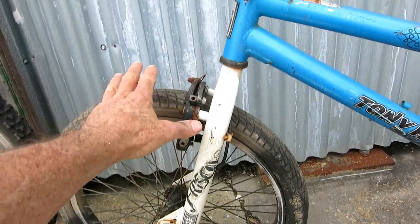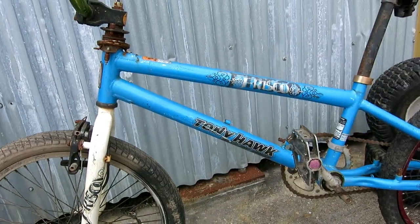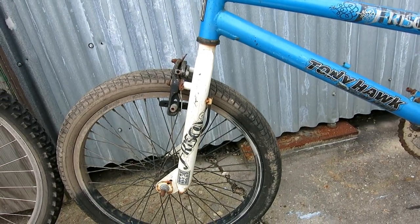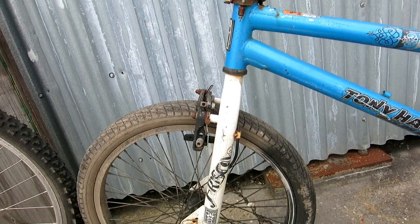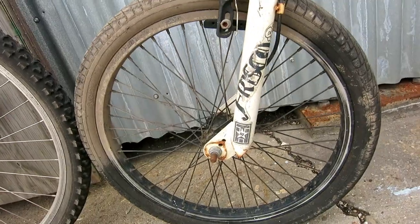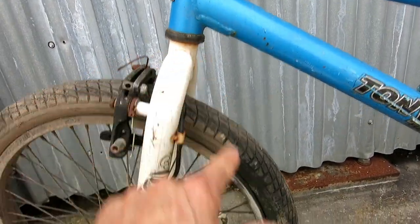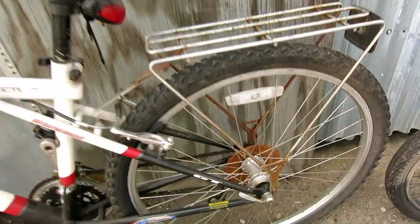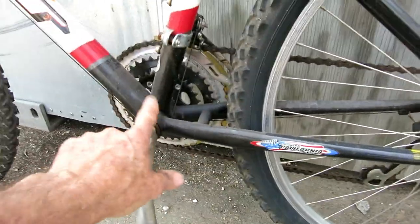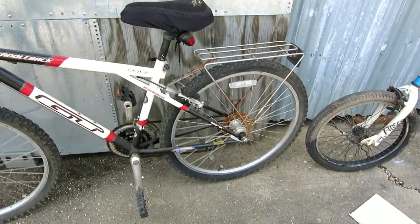I'm going to use this wheel and these forks and cut this, and the rest is junk. But before I do that, I recorded this angle because all bikes are a little bit different, and if you switch them up, the bike doesn't ride correctly. So I know what this angle is. I know how far this is from the ground, so I can set it up and adjust correctly. And on the big bike, I know how far this is to the ground and the bottom bracket is to the ground. So that'll help me set it up and get it welded pretty straight. So bring them in and take them all apart and start cutting.